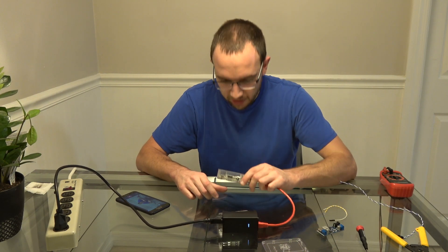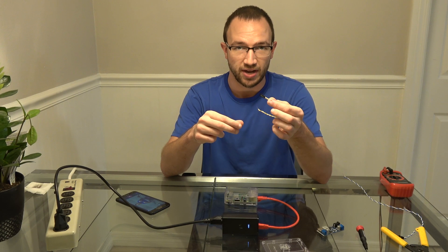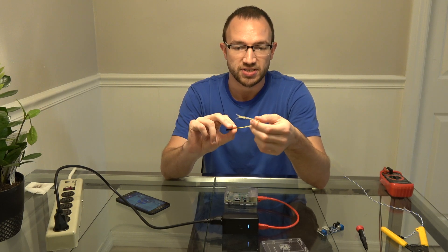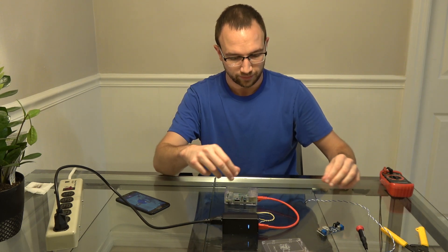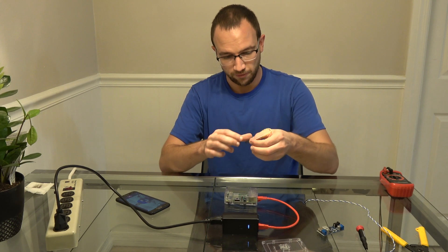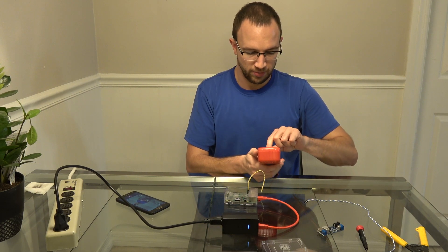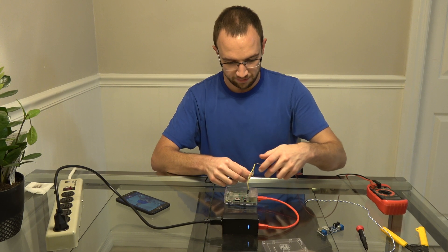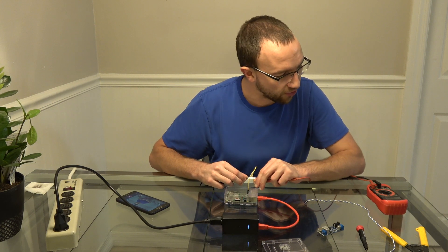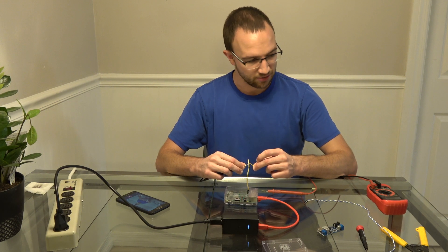Nothing's being powered — no smoke yet. We're going to use these wires from an old AT computer case we had lying around; it still has a turbo LED label on it. We'll use this as our voltage input and another connector labeled power switch for the power output. Setting the voltmeter to the 200 volt range because the reading is going to be greater than 20. Testing the first two pins — we already have 24.3 volts and it's positive polarity. So yellow with this configuration is positive 24 volts.